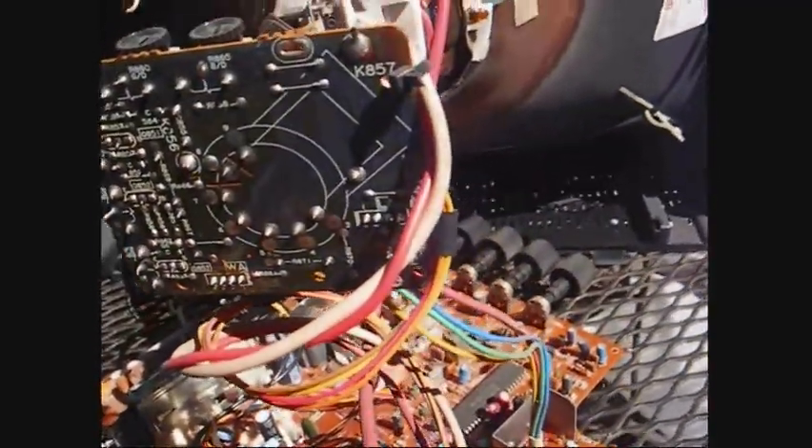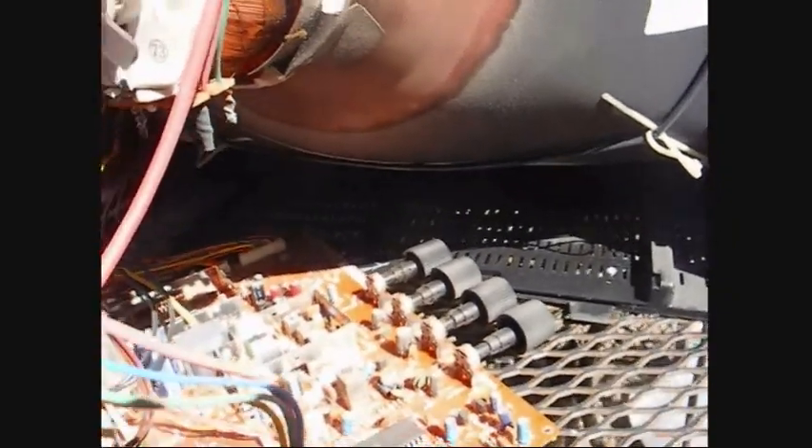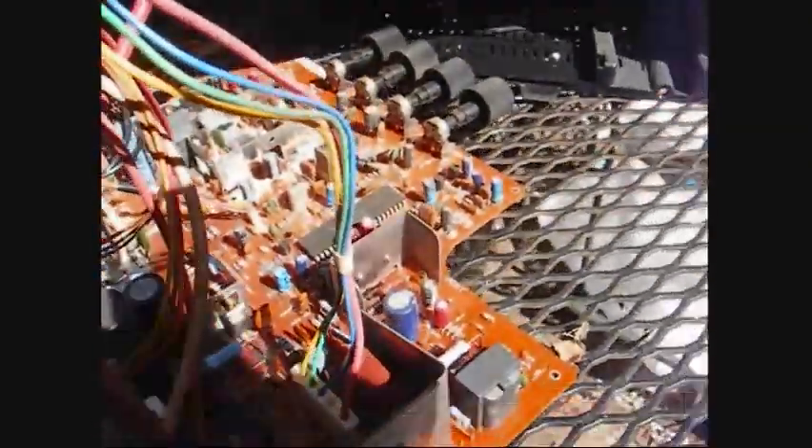The tube is a Sharp-branded tube, EIA-455. I don't know if Sharp was building their own tubes or just outsourced production and put their name on it. Judging by the looks of this board and the lack of dust, which suggests low hours, I really don't think this set is going to need a whole lot — probably just a cleaning of the controls and re-soldering any iffy connections.